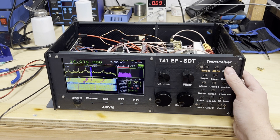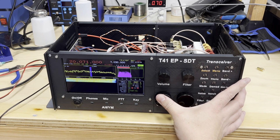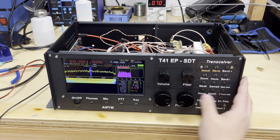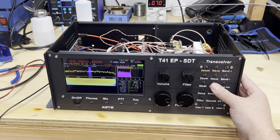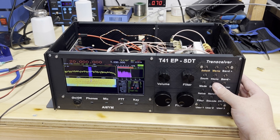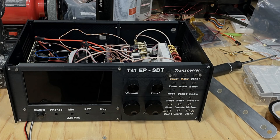This looks like some imaging and some other strong signals around, so there's more work to do. Then tuning in WWV on 20 megahertz, I'm going to click on the SAM demodulator, which will show us how accurate the temperature controlled oscillator is. It should be accurate within one or two hertz, and it looks like that's the case.